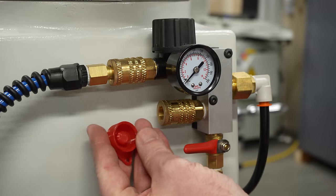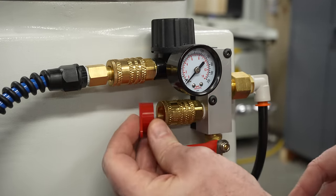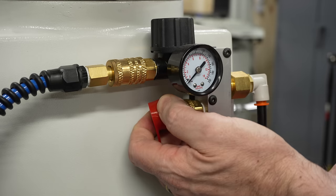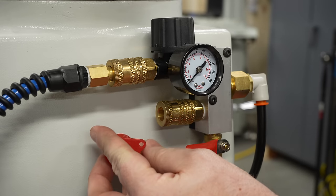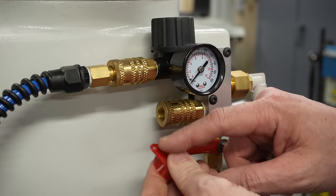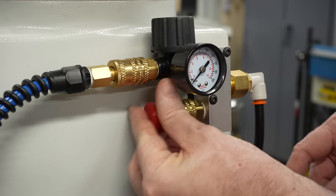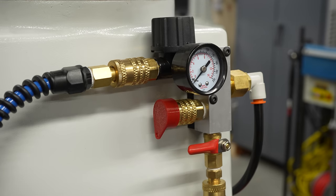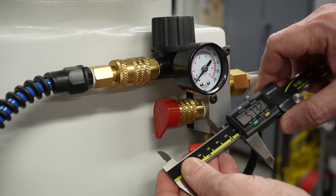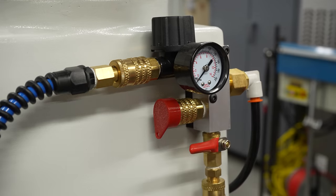Here's the part right off the printer. The result is really quite clean — the bottom surface against the textured bed looks great, the top surfaces have filled and closed completely, and it fits. We get a nice neat snap action as that little ring drops into the groove between the knurling passes on the connector. I think that is going to keep dust out nicely. We do need some kind of lanyard to hold this on — we left a hole for a piece of string or wire. Waving the calipers around in the air, this needs to be about 60–70 millimeters.